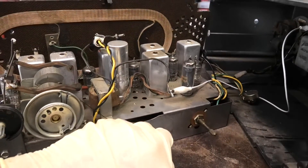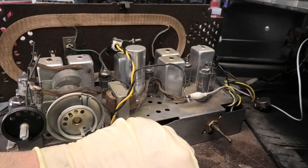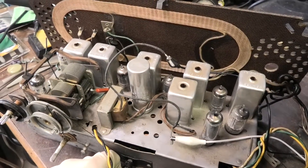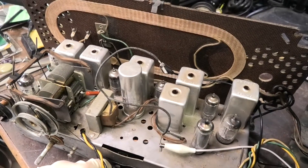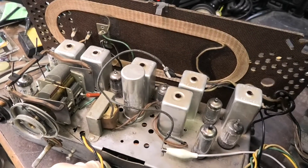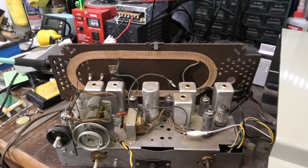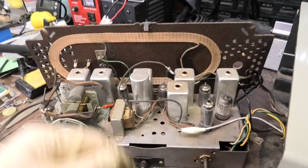Let's check the FM out. Your distortion — your wah-wah sound. This doesn't have AFC either, so its performance is going to be lackluster at best. Without AFC it's going to drift. But these 50s Zeniths are pretty good. The filter is staying cool and it's fine — I'll just leave it alone. I've changed these filters before and it's a big pain. If the filter ever goes bad, they can send it back to me and I can repair it.